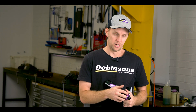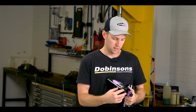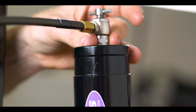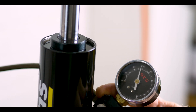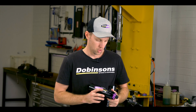We also ended up with adjusters where we were able to take away some damping from the main piston, which basically helps to distribute the heat a little more evenly in the shock. So now as we're doing some more damping on the compression adjuster as well as the main piston, we can run some slightly lower gas pressures. Again, that reduces friction and reduces seal wear — so many benefits in the adjuster and it really works well on these shocks.